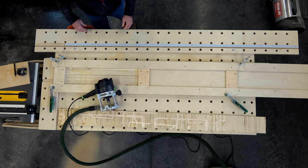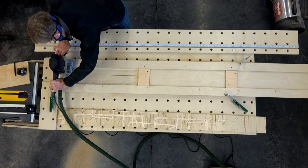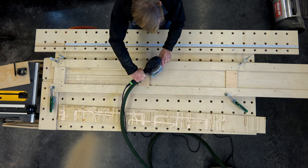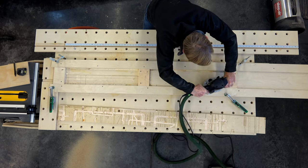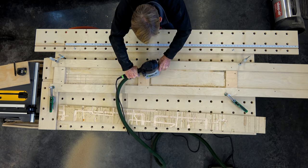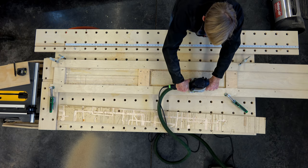This approach gives me a super clean pattern I can use over and over. Using a plunge router, I plunge down in passes — the first cut is shallow, the last is shallow — pull the fall-off piece out, clean it up with a vacuum, then make a final pass. Taking time to make this one template accurately and cleanly means I can make all four sides quickly and identically. I'll have it set aside for future benches too.